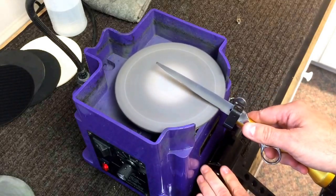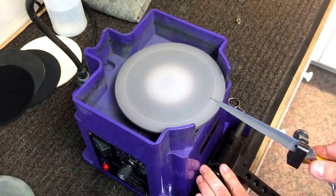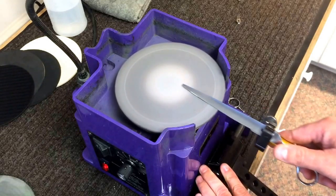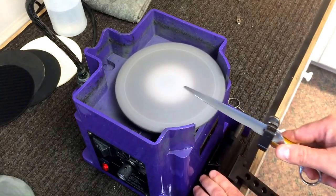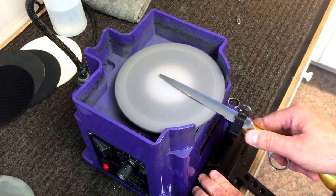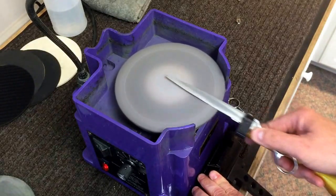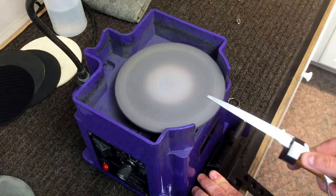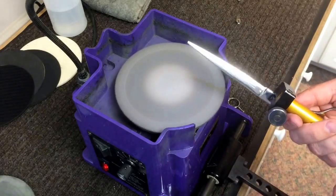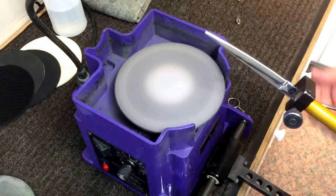So what we're going to do here is just make sure that you hold your tip up. Come across, back over, cross, and back over — still just working mainly that one little half-inch outer area of the disc. And again you would rotate, rotate, rotate, rotate, and do the same thing — working your way back down on that other blade, just to go ahead and blend those angles back in, and then repolish that front surface.